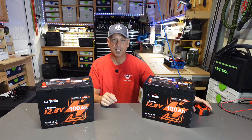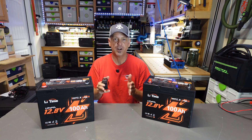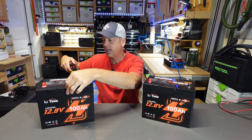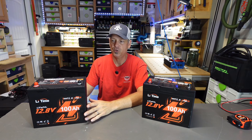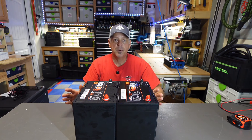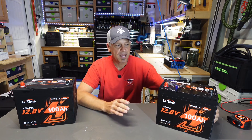These are absolutely perfect and I'm going to quickly tell you why. In terms of size, these are group 24 size batteries — very, very small, compact batteries that will literally fit anywhere. We are looking at 10 and an eighth inches wide, eight and a quarter inches tall, and six and a half inches deep. They're very, very small batteries compared to even some of the other mini batteries and especially the standard size 100 amp hour batteries. You can put two of these together and they take up a lot less space than a 200 amp hour battery would.